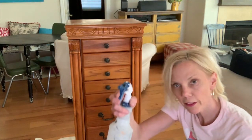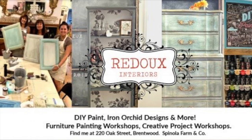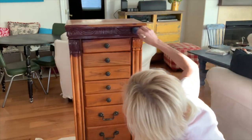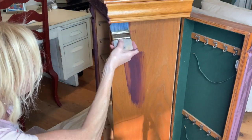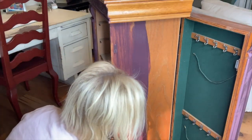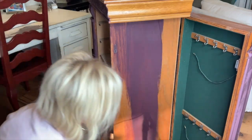I normally have one of those really nice mister bottles but I left them both at my shop. You can find my spray bottles and DIY paint at a little farming company in downtown Brentwood, California. I literally just frosted the very top of the paintbrush — it's such a pretty color, just watered down. I didn't sand at first because with DIY paint there's usually no reason to sand or prime your piece. The highly adhesive clay base will stick really well to just about any surface. For best results, lightly dampen your piece with water and use long, even strokes rather than lots of short back-and-forth strokes.